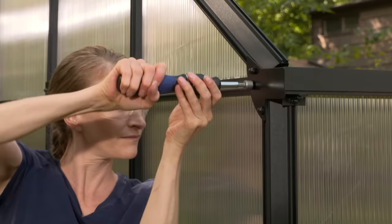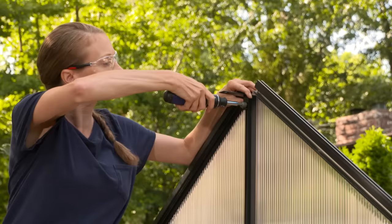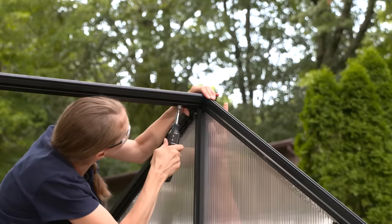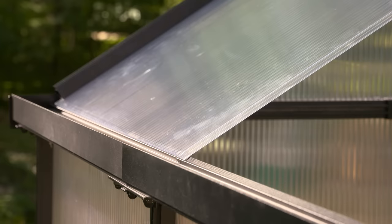On the back wall, attach the rest of the framing members, panels, and brackets. To secure the roof ridge, put the inside support brackets in position on the framing and then place the ridge. You might have to cut the tips of the angled panels to set the ridge in place, then secure it with bolts. To give the ridge some extra support, install 2x4 braces underneath just until the roof panels are installed. Clamps can help keep them secured.